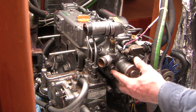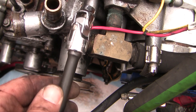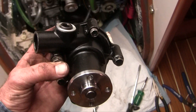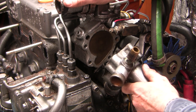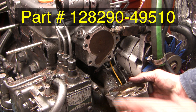Let's move the ball forward with this water pump. We've got five bolts here — these are 12mm. Interestingly, the most difficult bolt is this one right here — I had to use the 10mm universal joint. I put the bolts into the new water pump just to remember which the long ones are. This one here is the longest bolt and the shortest bolt is that one. The three bottom ones are all medium length. Now I just need to get the bottom hose off and then we're out. I made a stupid oversight by not ordering this hose — hoses that sit so close to the engine get heat soaked and soften up over time. They need to be replaced every time and they're a lot easier to get at with the pump off. I tried to swap in a generic hose but the bend is too acute, so I'm going to need to order and wait for a custom OEM hose to come from the dealer.